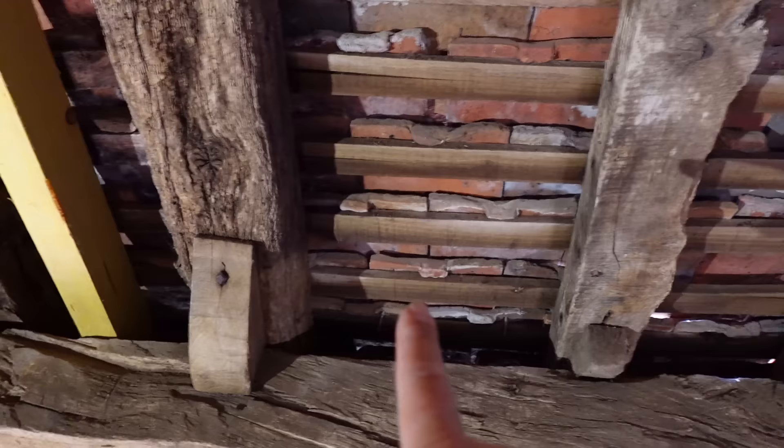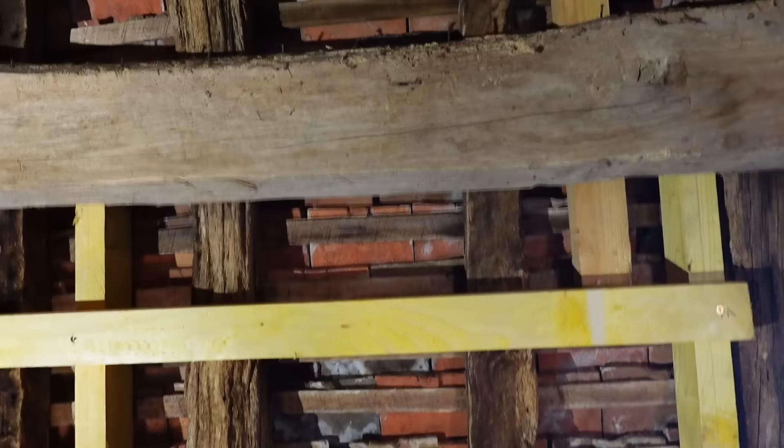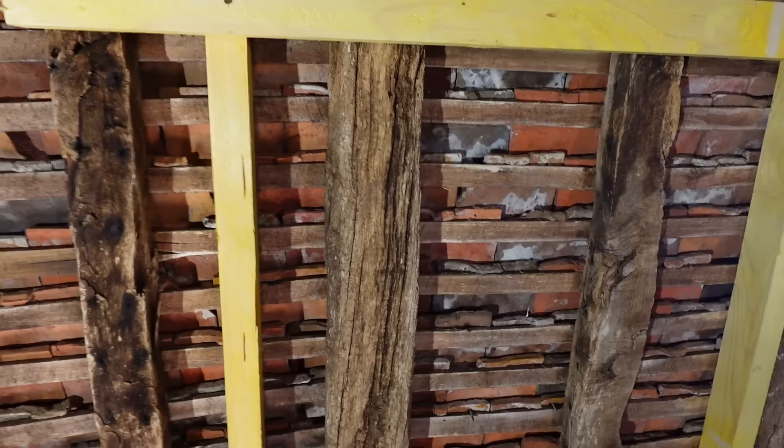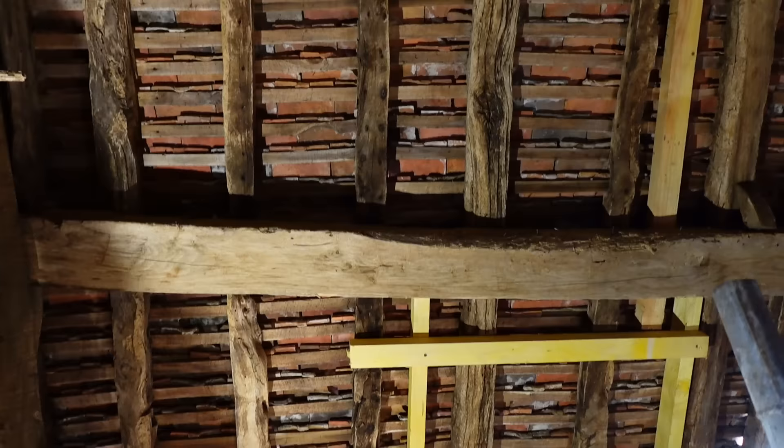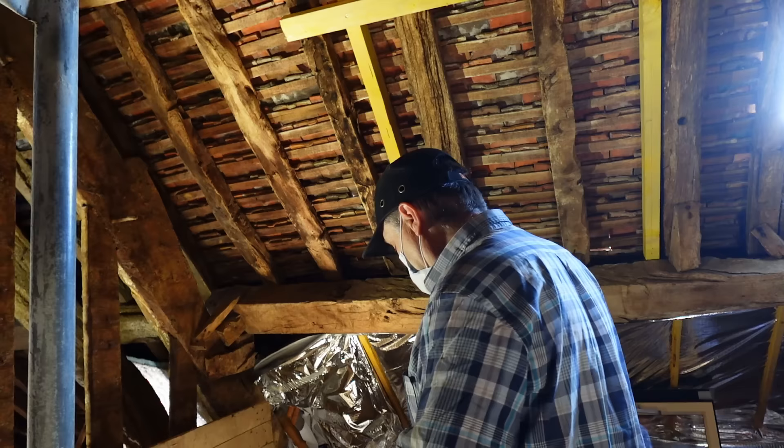The wind's getting up and because I can't run a timber across here at the moment, I'm going to put some angle brackets on. Square it all up so I know that opening is where it's going to go and it's not going to move. Then I can work above and secure that area. If I step back a little bit you can see what I mean — that's going to be the opening in relation to the rest of the roof. So just square it off, pop one of these on, then I know it's not going to move.